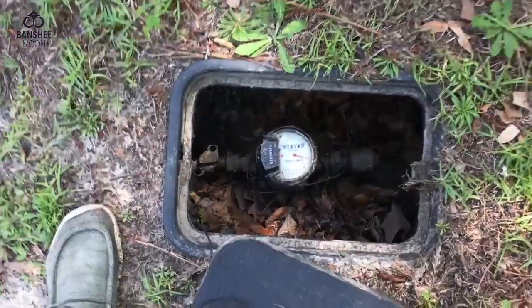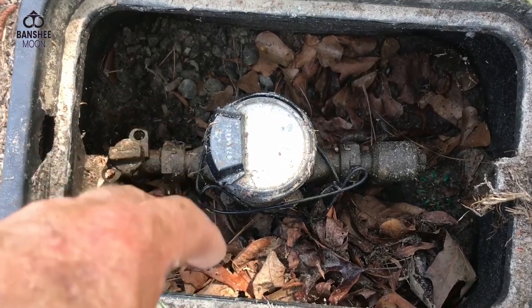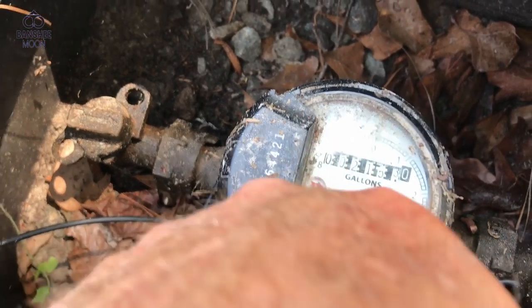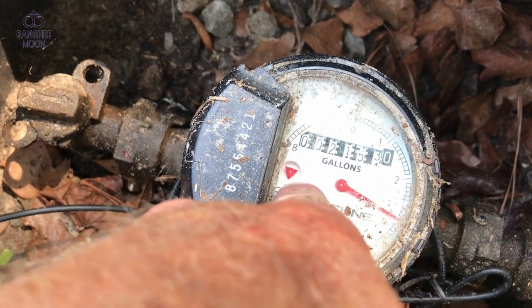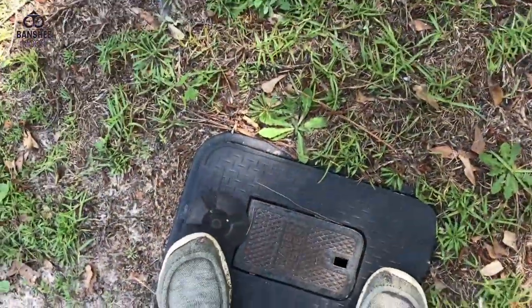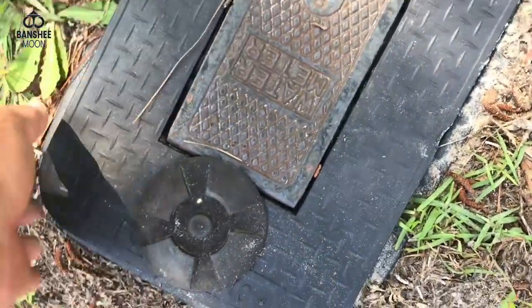Enjoy your visit. Okay, now I have made sure that everything is turned off. The hose bibs are all turned off, ready, tidy. And you want to come out here and you turn your water back on. I've turned it on, and watch. Make sure that nothing is moving. I've got this little indicator here that would be spinning if there were any water moving through here. So that means to me nothing's leaking. I did a good job. But I've been doing this many years, doing my own plumbing stuff, a lot of it anyway. So that's what I expect.